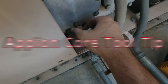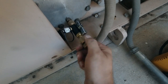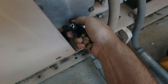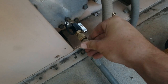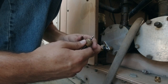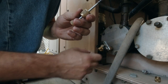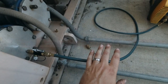I'm still going to do those tips — stick around for that. Word of caution: whenever you're putting on these core removers, don't snug it down before you've pulled the core. If you do, you're going to get that stem stuck in there. What you want to do is put it down just enough to where it tightens, then take your stem out. After you get it backed out, it should push out — close your valve and you should have a stem. What happens is the o-ring in there, as you tighten down, will pin.